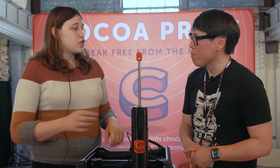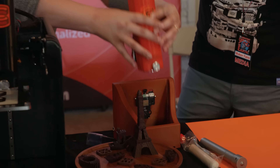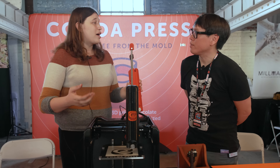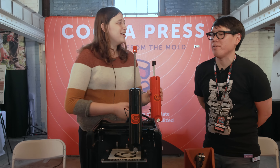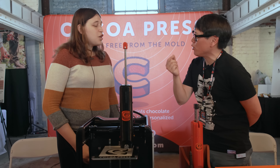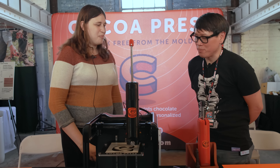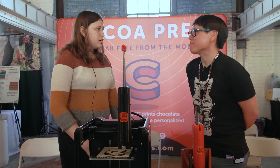The other really cool thing is we now have a swappable extruder. With just one button, we can take off the entire extruder and swap it to do either bigger prints or even multicolor — so you can do a manual filament swap, have dark chocolate in the machine, then white chocolate, externally heated. I'm really excited about the ability to hot swap the nozzles. We have a 0.8 millimeter nozzle and a 1.6 millimeter nozzle. Everything's compatible with Cocoa Press one and two. Swapping the entire extruder also makes it easier to clean.